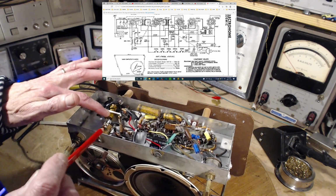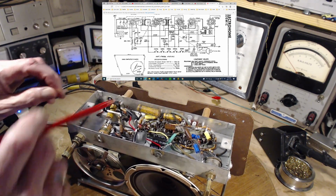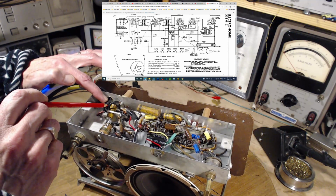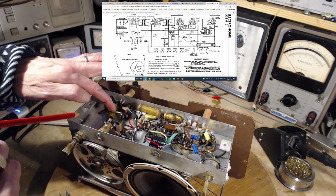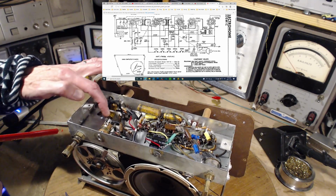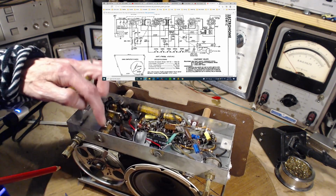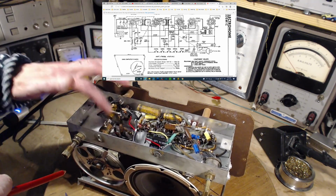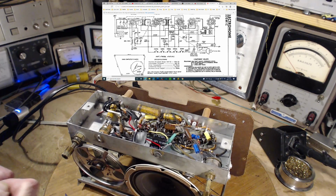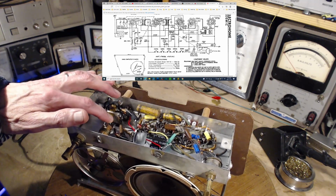And so this one's job is the one that's got me scratching my head a little bit. It's right across the power line, though. You can see the power line coming in. The power line connects right here. So does this capacitor. The other side winds its way up to this terminal. And although this is on a coil, this is actually a ground point, or again, a B-minus point in the radio to connect to. This one might be just a wee bit different, come to think of it.